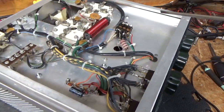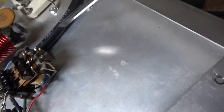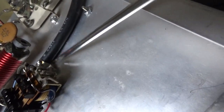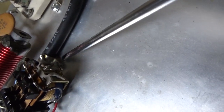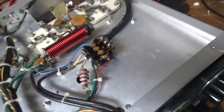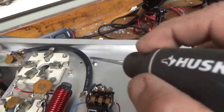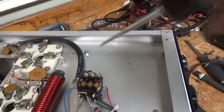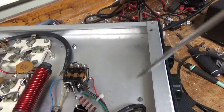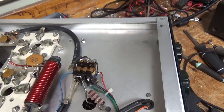This thing is all set. I also had to redo this over here — the screw was loose for the load air variable capacitor. The guy who built it didn't put the nut underneath between this bracket and this hole, for the ground connection on the output coax. He only had a nut on the top, so I put one below, tightened it up real good, and put a nut on top with an internal tooth crush washer. The shorter cap uses the screw hole that's already here — it did not have to be drilled, it's nice and tight. You always want the air variable capacitor on the plate and the one on the load to have a really good connection to the chassis.